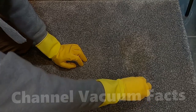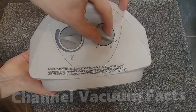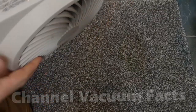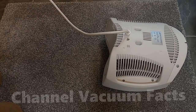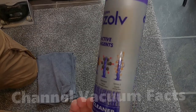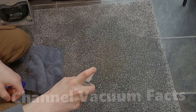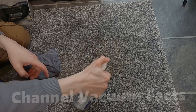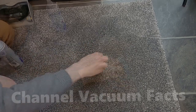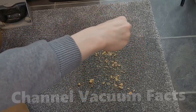This might take a few more minutes. At this stage it's as clean as you're going to get it with water-based cleaning methods. I put a cool fan on it and left it to dry overnight, although it will take days for the very base of the carpet to dry completely in a dense carpet like this. This is why prevention is better than cure. Once it's mostly dry, you're back to the stage where you can use dry cleaning chemistry. Spraying with Dissolve and blotting helps get out much more of the stain that the soap and water-based chemistry struggles with. After a few minutes of blotting, you can scrub in some micro sponges to get deeper down.